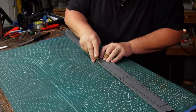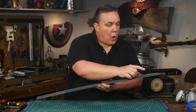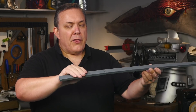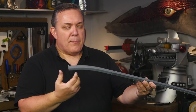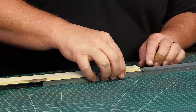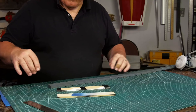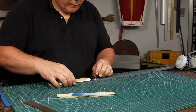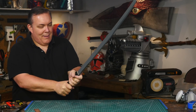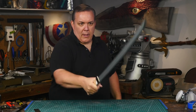Then I cut the curved blade out from the oversized blanks, making my cut outside of my pattern lines. The graphite rod goes almost to the tip and only a little bit into the actual grip, so the grip needs to be a little thicker anyway. In order to combat this, since the graphite tube isn't there, I'm going to glue a couple of painter sticks to it. I mark how long the paint stir sticks need to be and cut them to length on my band saw. These are the larger stir sticks for mixing a five gallon bucket of paint. I'll just sand it down because it's not supposed to be square, but yeah that'll work totally.